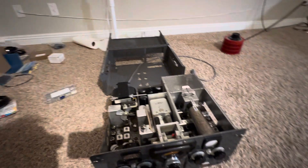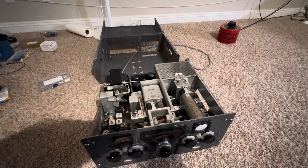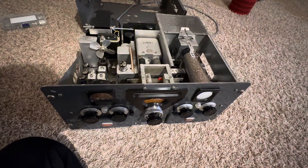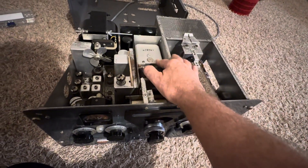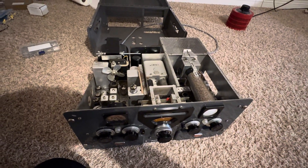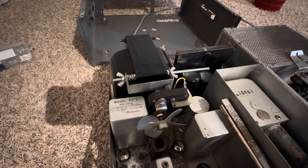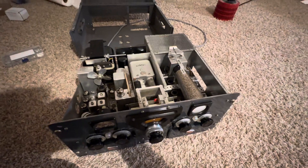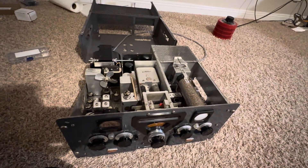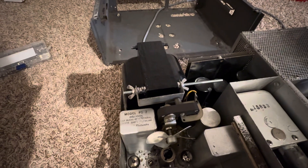Maybe learn artificial intelligence or something that would make some real money. Anyway, that's my dilemma. I got to get back to some work stuff, but this radio is built like a tank. I spent days just fixing this VFO thing here and getting it working. This is a very stable transmitter once you have it working. Maybe I can shoehorn a Tempo 1 transformer in there if I can get the Tempo 1 power supply cheap enough from one of the eBay sellers. That's probably going to resurrect this radio. This transformer looks beautiful, but it just has way too many volts coming out of it.